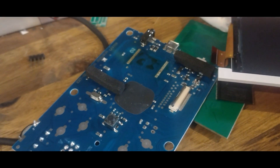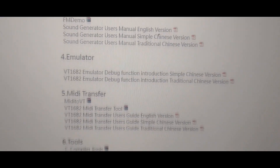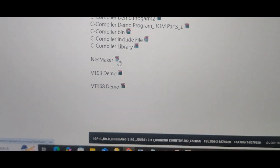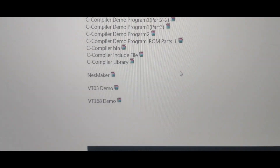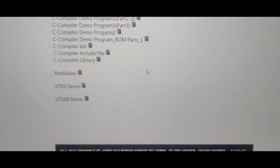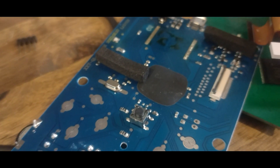The globtop used in these consoles is by a company called VRT. If you go to their website, you can find emulators, a whole bunch of tools, including compilers to make your own ROMs, and also a tool called NESMaker which creates the multi-ROMs. You can use that to add all your games, the mapper is restricted to Mapper 0 and Mapper 4, then compile that into a single file, flash it to the chip, and it should just work. That makes it really easy to modify your own ROM pack.